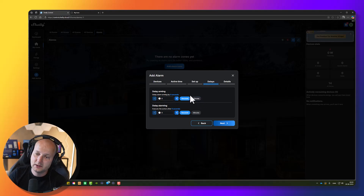Here you can add a delay when arming the alarm — you can set it in seconds or minutes. This is useful if you have a button or keypad inside your house, so the alarm doesn't trigger while you're still inside. You can also add a delay when disarming, so when you come home and open the door, you have time to come inside and switch off the alarm. In this case, I'll just keep it as it is.